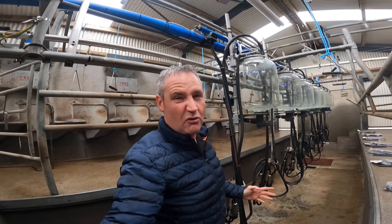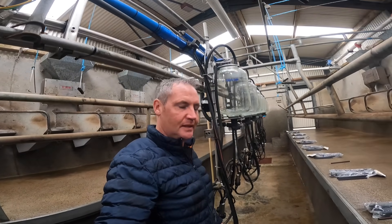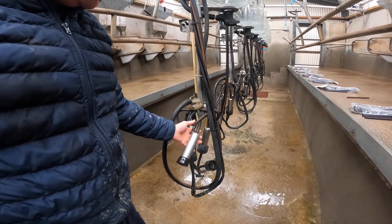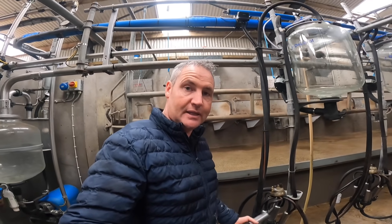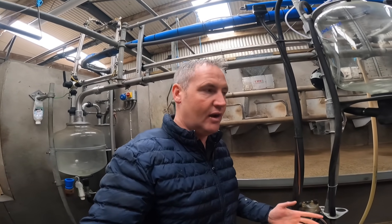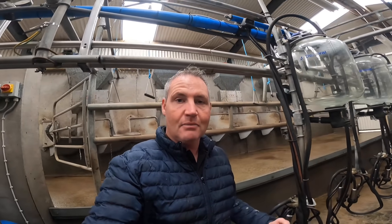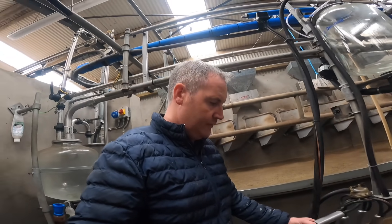The next job is not really a repair but maintenance — we're going to do a mini service on the milking machine. I do this every six months. All we do is basically change the liners. The liners are these lads here that fit inside the shell, and these are the pulsation tubes. You must keep the liners in good order because they can crack, and after milking cows for that amount of time they're going to wear. If it's not right or has cracks in it, that's the first thing that's going to irritate the cow — the cow is going to be uncomfortable.